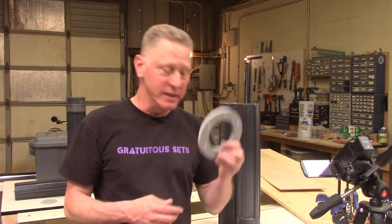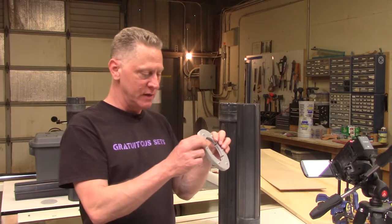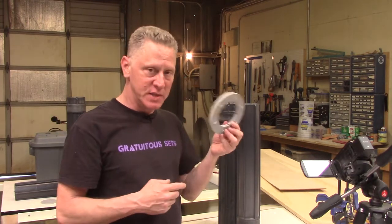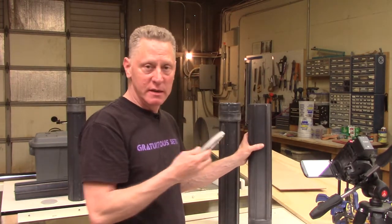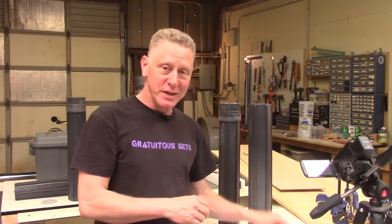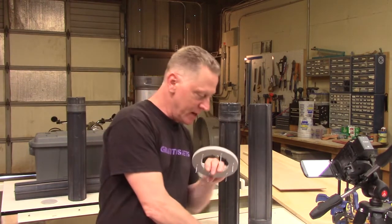This is one of our trim rings that we've made. I took a bunch of measurements off this thing, Matt modeled it up, and cut these out of 2 layers of Sintra, which is PVC, on the CNC machine, and we're going to be attaching those momentarily. A little glue technique that we're going to show you. But first, we're going to use pop rivets to put these guys together. So I've got a bunch of pop rivets sticking out of this thing right now.